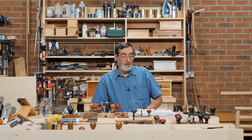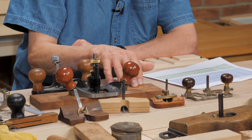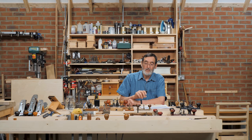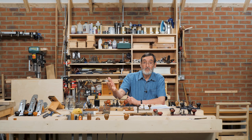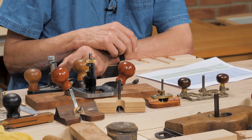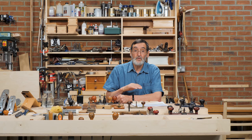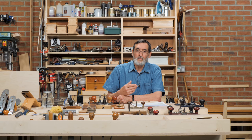How thick should it be? Well, there's one here that's quite thick — this is a borrowed one from Hannah, and hers is quite thick, but she has enough depth for the work she's likely to do where the thickness isn't going to impair her. If the base is in the way and it's too thick, she can just take it off and use it without the base. I've been using a wood called Sapele, and the reason I'm using Sapele is because it's stable, and once you've planed it flat and got it parallel it works perfectly long term. It doesn't mark the other wood — that's the important thing — whereas some of the more oily woods will leave a mark on the surface of light hardwoods.